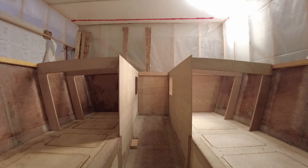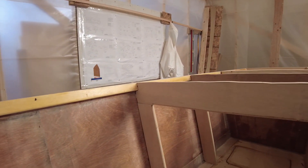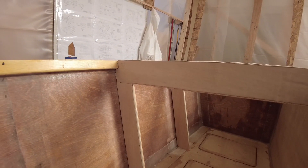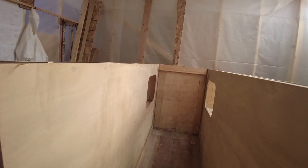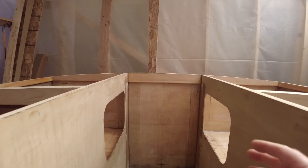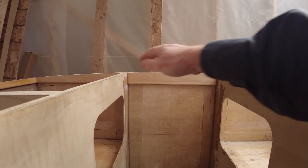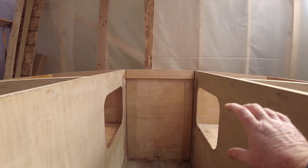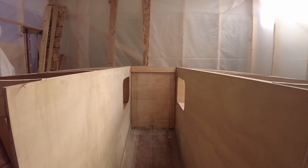It's the next day — I've just removed the clamps. I'm very happy with it. The ring frames are now secured in their proper positions, as you can see with the little black marks. I'll put a proper fillet on them today. In this central area I need to get a continuation of a bulkhead straight across to connect these two major bulkheads together, and also a secondary small one at the point where the back of the main companionway hatch will exist. Anyway, a lot to do — time to crack on.